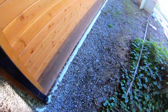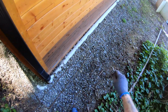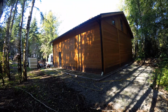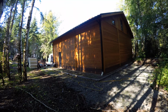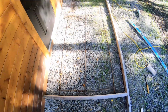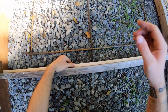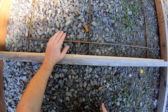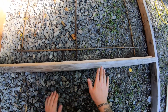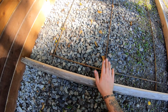So I just got to check that board and add one more 2x4 here. Stake it off and level it. This will be my stopping point. I screwed on a little 1x2, so that'll help when I pull this board off, that'll leave a little void in there. So when I pour this against this, it'll go into this void and lock into this slab, hopefully.